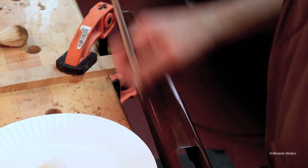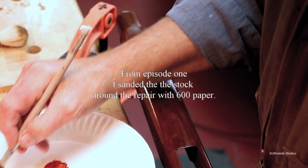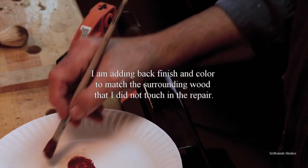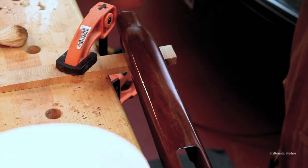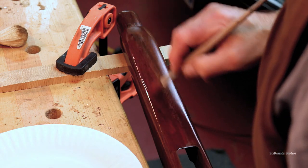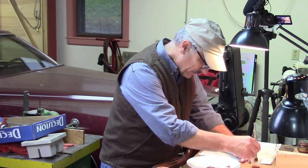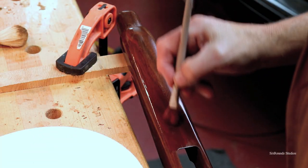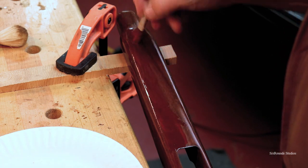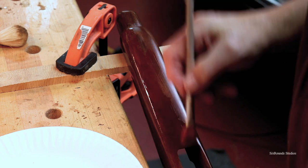I'm going to add a little bit of that finish through here, and then start blending my colors into that finish. There is a definite red tone to the stock itself, so I'm going to push this a little bit on the red side. That's already making a difference — it's a little too red, so let's add in a little more brown. The idea is I do not want to make this so thick and opaque that you don't see the grain below it.